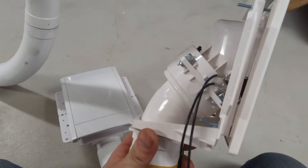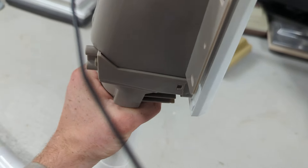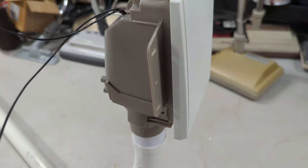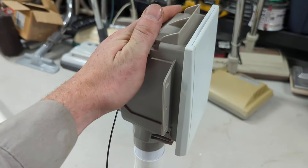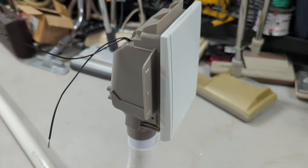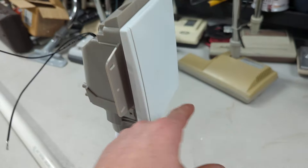So: Hide-A-Hose is cheaper to rough in, more expensive to finish. Chameleon is more expensive to rough in, cheaper to finish. A lot of people think it's the securing of the valve box to the stud that makes it really secure, but in fact, on any of these — and in a standard central vacuum — it's the sandwiching of the box behind the drywall and the door in front of the drywall that provides stability, not the attachment to the stud. The stud attachment just gets it in the right spot for piping and so the drywallers can cut around it.